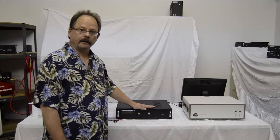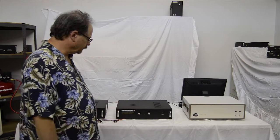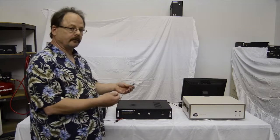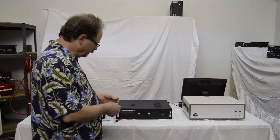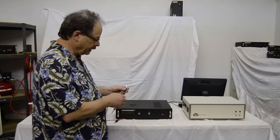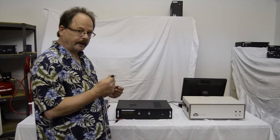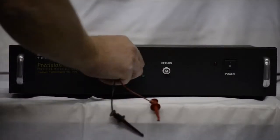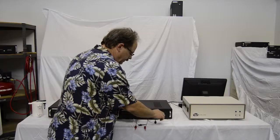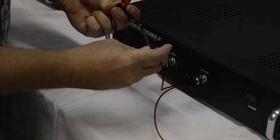There are any number of ways you might attach your sample — always BNC at this end — but you might use micro-positioners, a probe card, or in this case we're going to use the mini grabbers that are provided with the tester. The center pin signal is connected to the red pin of the mini grabber; the outer sheath, which is system ground, is connected to the black pin. Normally, I will take the two black connectors, which are at ground, and connect them together to make the run a little stronger.